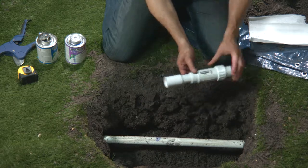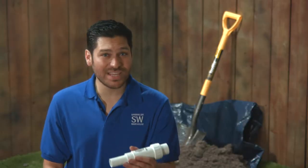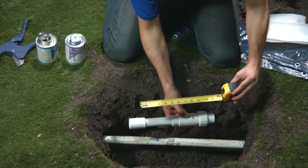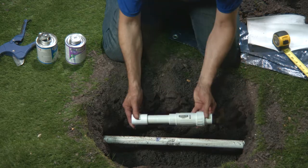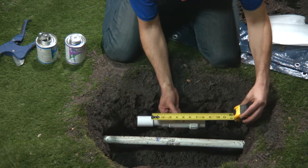That should set in a couple of minutes. The thing I love about using this expansion coupling is that you don't have to cut out a particular length of pipe. As long as your cut falls between the maximum and minimum expansion, you're good. For example, using this one inch fitting, we can cut between 10 inches and 7 inches.